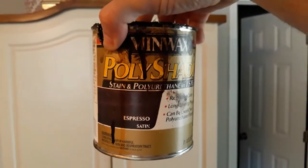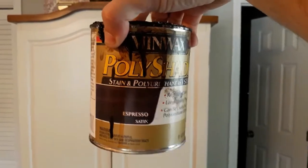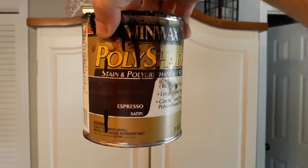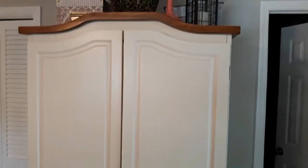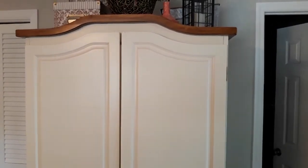The first option is PolyShade. It's essentially polyurethane with dye in it. I did a test of this and it just doesn't apply consistently with the grain of your wood. It's almost like applying a coat of paint to your polyurethane-finished surface. It will darken it, but it may look more like something that's painted yet transparent — you'd have to apply it and see what you think.